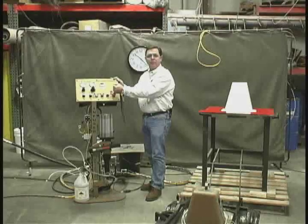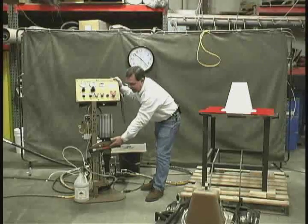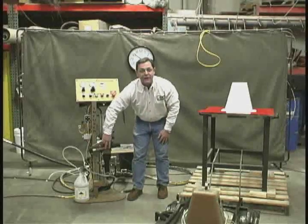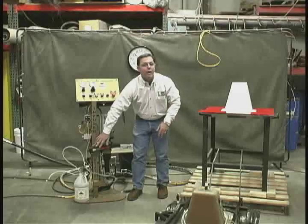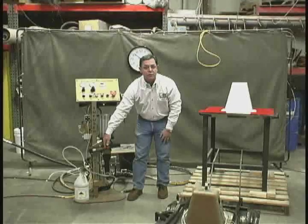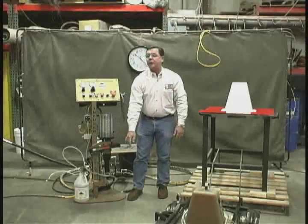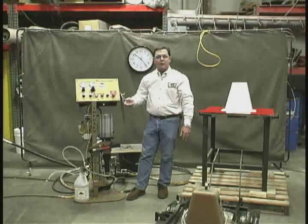We have the ability to infinitely vary our catalyst ratio by simply turning the screw and moving the ratio along the slave arm. We color-identify the levels: when we're in the red, that's typically too much catalyst. Even an operator not aware of the process details would know that red is beyond normal. Green is the most common area for catalyst ratios, and yellow is typically too low — running in yellow often leads to an under-catalyzed situation.